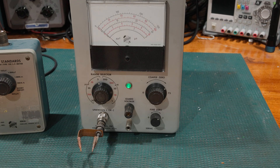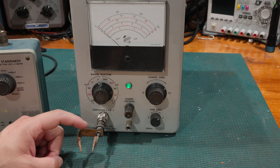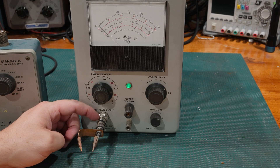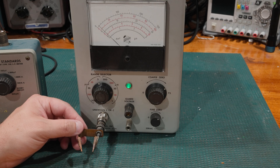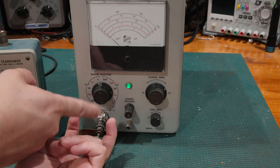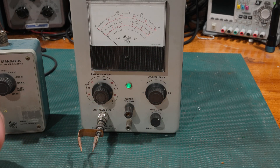That's our first real challenge: we need to get a good reference into the front end with as little capacitive coupling as possible. That's one of the reasons this particular unit is constructed this way — we have a coax cable, a very thick ground lead that would actually be the negative, bolted to this connector on an adapter going to the PL-259. Even better would be directly on the PL-259. This is a makeshift version of the original test fixture, which was directly on a PL-259 connector with two forks. I don't have one, but because it zeros and the needle settles, this works okay and I can read down to the lowest ranges.